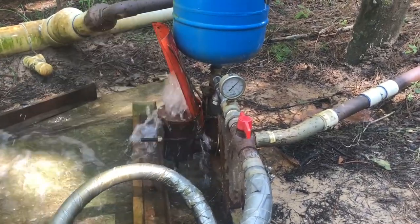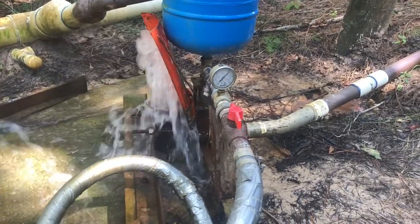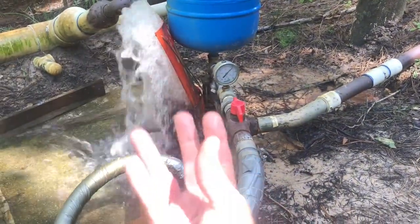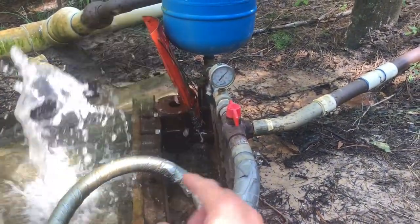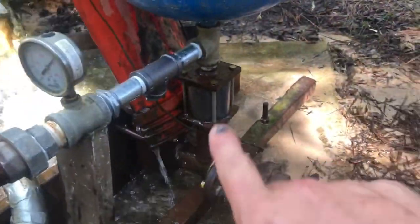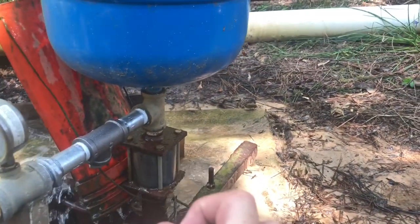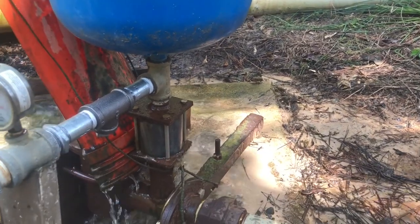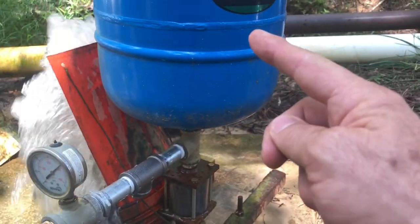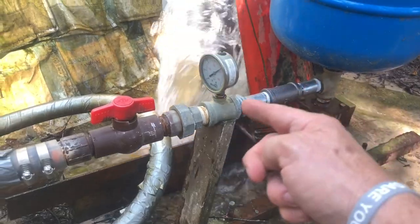Inside there is a glass ball letting the water by. It has a set of fingers underneath that is adjustable up and down, so you can set the stroke of the glass ball letting the water out. The little window got fogged up — this is a clear window. There's a pinball in there that is the check valve. Every time you hear that click, that's the check valve letting water into the pressure tank but won't let water back out. Then the service line comes off of there.